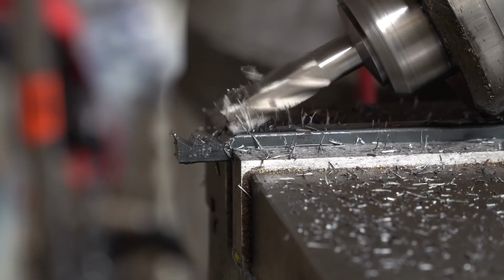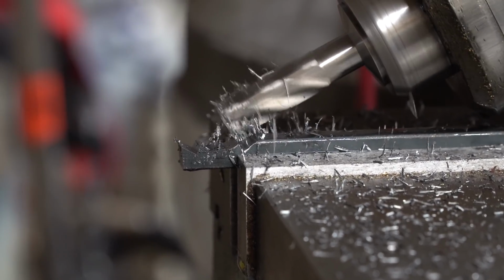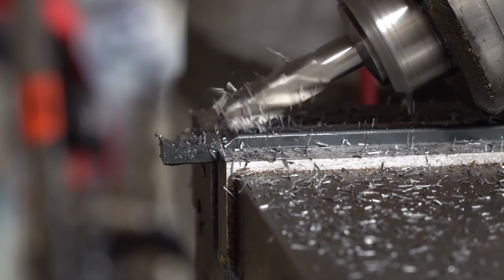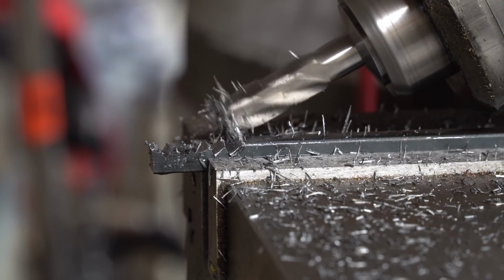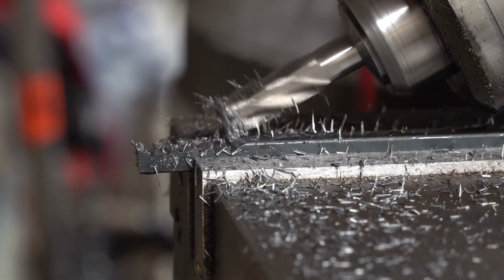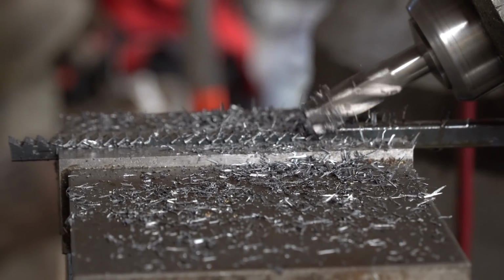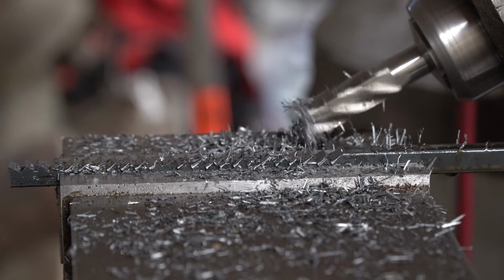Now, this crazy angled Bridgeport mill setup that I have here is to cut the legs or fingers, as I talked about previously, that clear the chips out of the mortise as you're cutting. And the original patent documents have something exactly like this in the drawing, which is kind of a stepped or toothed square bar that you would shove in the hole, and as it moves back and forth, you will see later on, in a rocking motion, it clears out the chips.